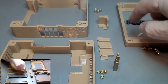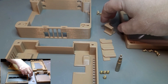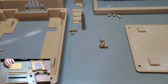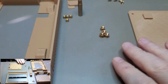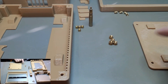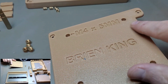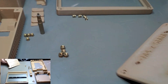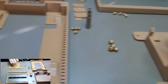This is the USB and this is the SD card tray. If you want to use inserts, which I highly recommend, these are M4 by 4.7 millimeter. These four will go into the holes here for your 75 by 75 millimeter VESA mount if you choose.